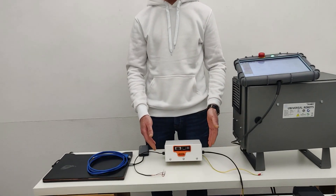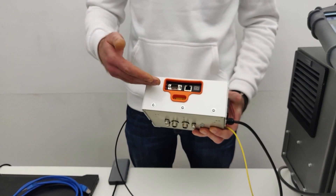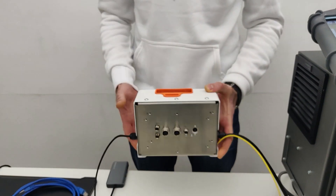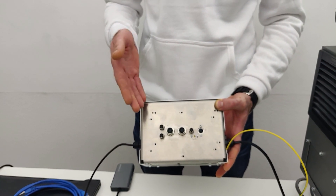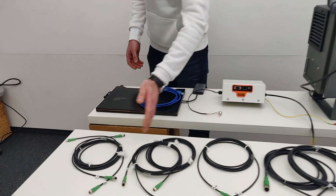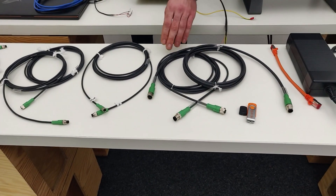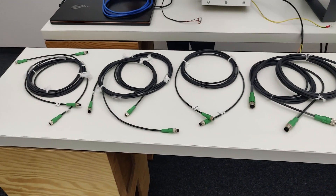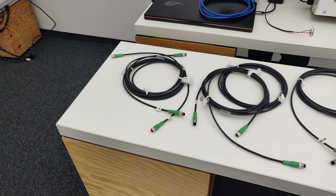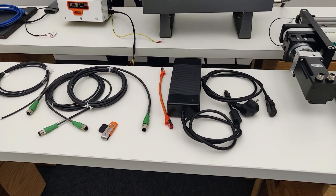Here you can see the main part of the TruLifter kit — this is the motor controller box. Inside is an IGUS Drive D1 motor controller as well as a dual channel safety relay. On the bottom side, you have all the sockets to connect the motor controller box to your linear axis. The standard cables you see lined up here are to connect the motor, the encoder, the brake (optional of course), the limit switches — positive as well as negative side — and we also supply an extension cord fitting to the length of your axis to reach the upper limit switch.